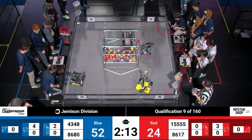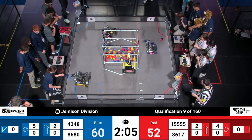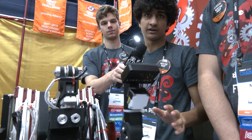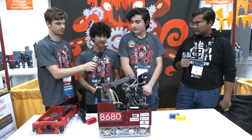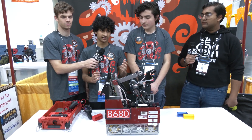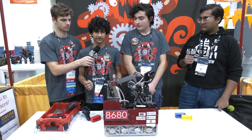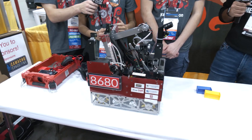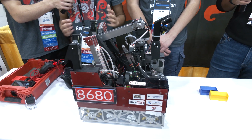Talking about autonomous — I see the Limelight. We have it on a rigid mount at an angle so it sees mostly the tops of the samples as it looks down, giving us a good FOV. Since the Limelight FOV isn't the best from what we've experimented, we use a homography perspective transformation: we set out a 12-by-12 aluminum plate and map the homography points so it scales linearly between the top and bottom of the image frame. We then run a contour detection algorithm by first identifying edges and making contours, and detect samples based on which rectangle has the closest to a 7-to-3 aspect ratio — that lets us identify individual samples and determine their position as accurately as possible. Yeah, that makes a lot of sense.